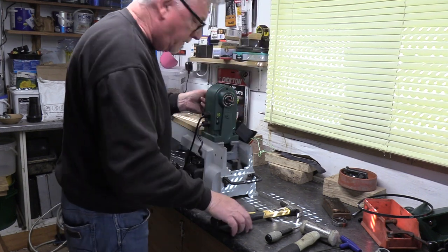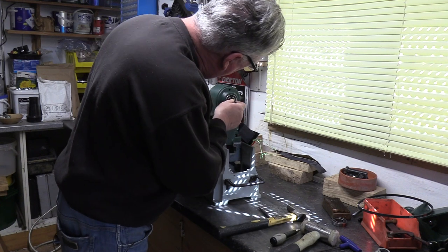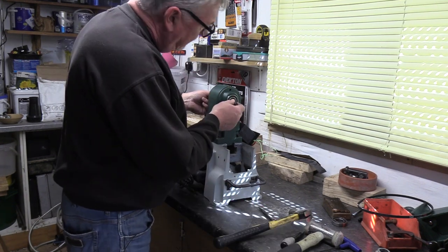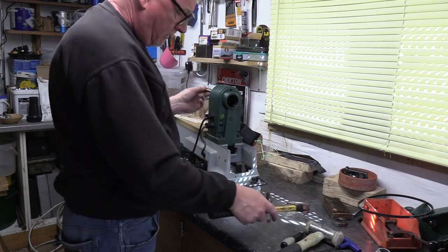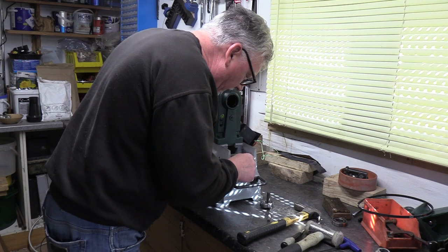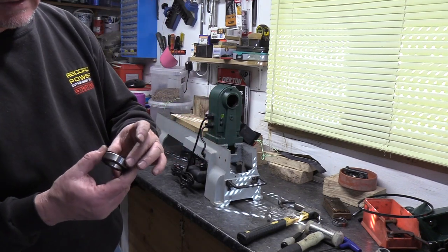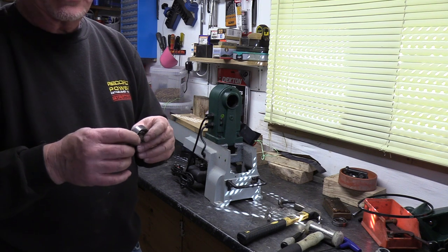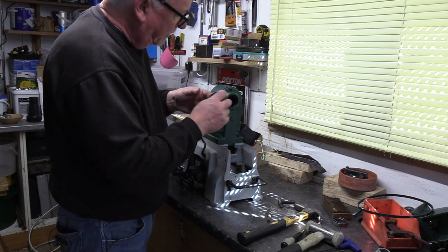I should be able to do it. It's coming nicely — just try and keep it in the centre. There we go — that's our bearings out. Also what you're going to find in there is a little spring wavy washer. That sits between the circlip and the bearing face, and that's just to put a little bit of preload on there. So it sits up against that circlip, and you put the bearing up to it then.